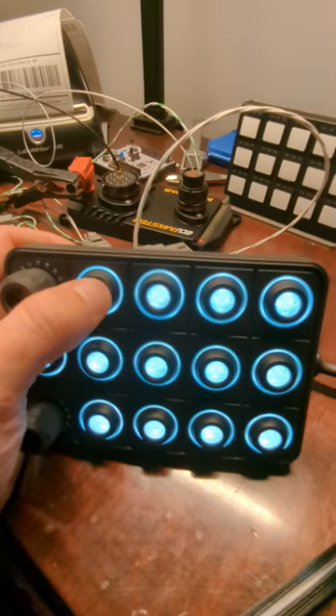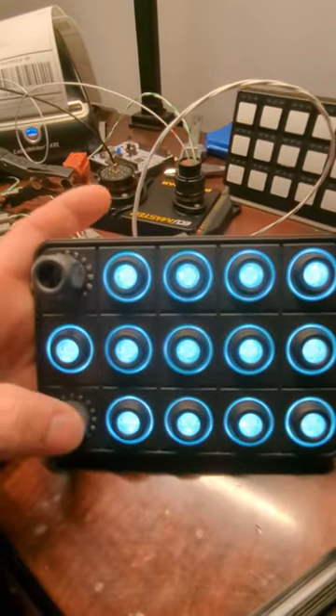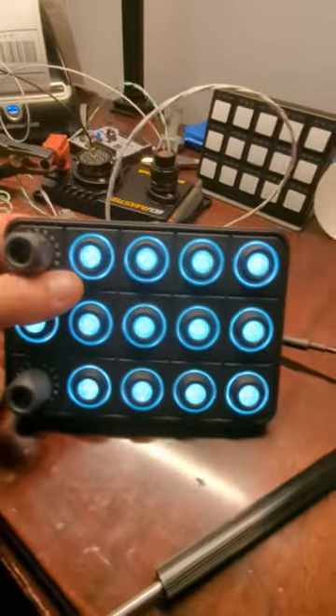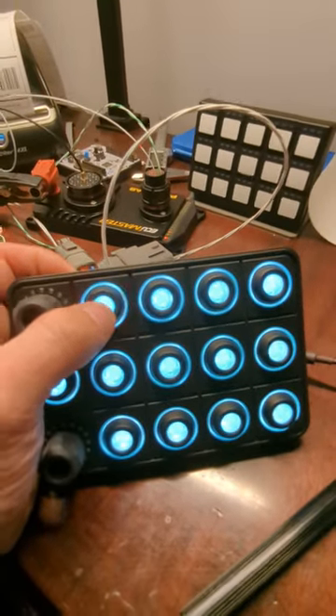For the error states, I have them set up for a flashing red. It's because I have a minimum current threshold, and as you can see behind me I have absolutely nothing connected to the PDM yet. But it'll blink red to tell us there's a fault state.